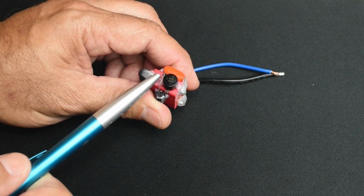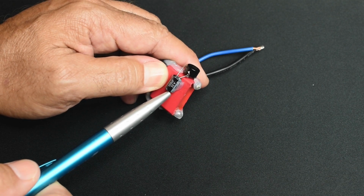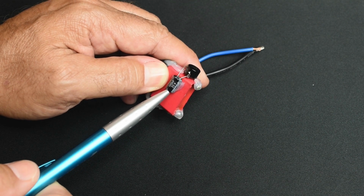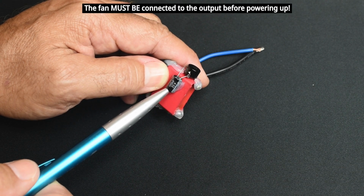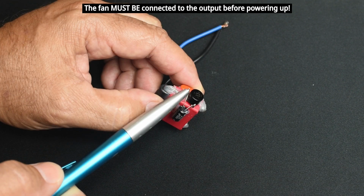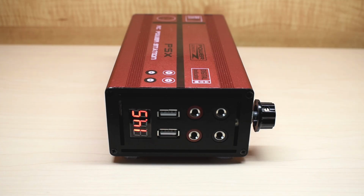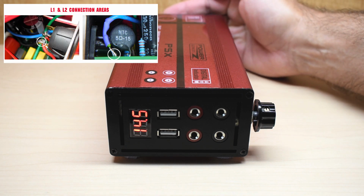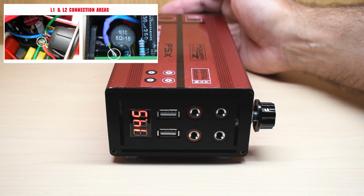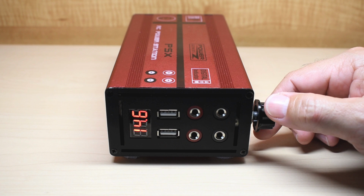The positive and negative on the bridge rectifier connect up in parallel with this 35 volt 100 microfarad electrolytic capacitor. The purpose of that is to smooth out the ripple on the output. You would take the positive from the cooling fan connected to this point right here, and the negative from the cooling fan to the opposite side. With the transformerless power supply installed, you can hear the fan running very good. And when I lower the voltage now, the speed is not going to change.